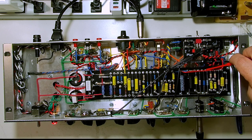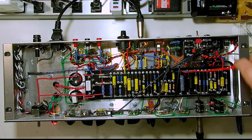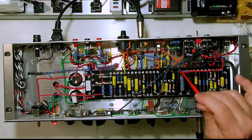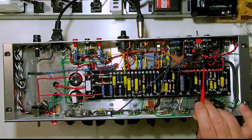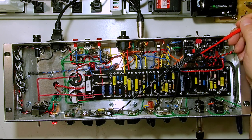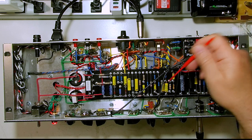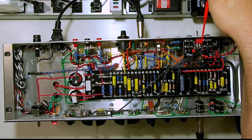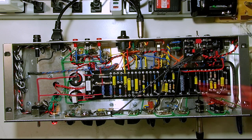This is the power line going to power the effects board. I had pushed it out of the way when I was working on these down here — I want that standing up and over here more. We got these heater wires out of the way. There's some potential for some issue with the effects loop here, but in my testing I couldn't do anything once I got this here to make the oscillation any better or worse with the send and receive of the effects loop. So I think we're good with this.